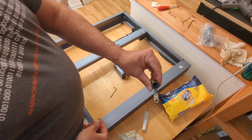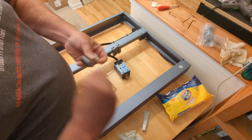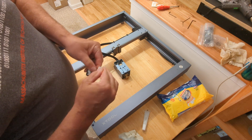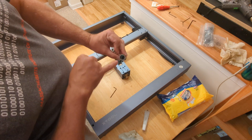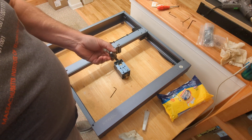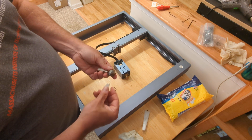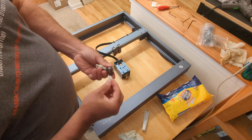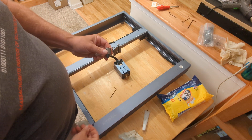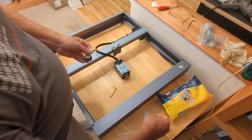Come in here and take a look at the nozzle. I know some of you use the air assist module that doesn't use this cone — that's great. But you do want to inspect inside of it and make sure the hole isn't obstructed at all. One time after cutting a really nasty batch of plywood, I had a whole bunch of gunk caked up in there. I should have given it a little more attention sooner — lesson learned. Clean up on the outside; if there's anything on it, you can work it off with your fingernail or maybe a razor blade. Be careful and make sure everything's clean.